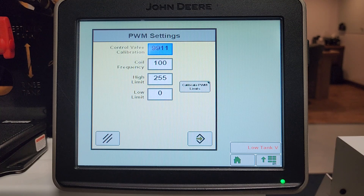Your pump should then react faster. But you don't want to put in a rate that is too fast or too slow. If your pump is always too fast, you're never going to lock in on rate and it's going to keep surging. If your pump is too slow, you're never going to get to target rate, or at least it's going to take quite a while.